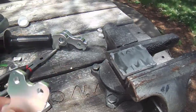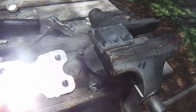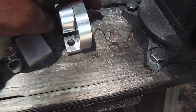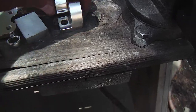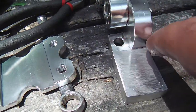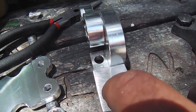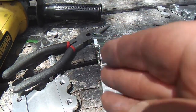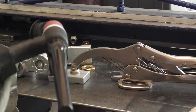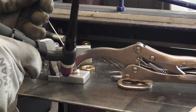You can see how I'm using some of the cast-off parts as the flange. I traced out what I think will fit well on this flange right here and add to it, because there's only one place for a bolt here. I've cut out a piece of the existing stuff, so I'll weld it across there and under and over, and maybe even build up a little gusset coming down off here. I'll drill another hole here, because that's where all the tension is — back and forth, nothing lateral. I'm probably going to hit this with quite a few amps; I'm only set to about 13 CFH of argon, which might be a little low, but let's just do it.